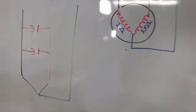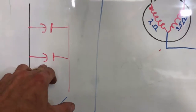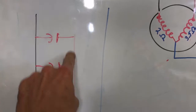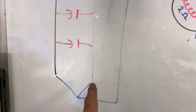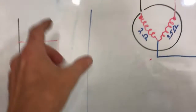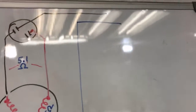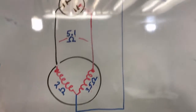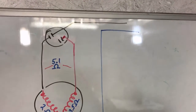Just remember: red wire by itself, black wire just kind of runs straight through the capacitor. If you have an electric motor that has both a start and a run capacitor, the red lead connects to both capacitors on one side, the black lead just runs straight on through to power, and the blue lead is the other side of the power connection. So you've got your two wires — bing boom bam, you're done.